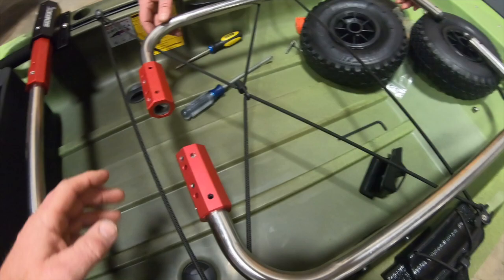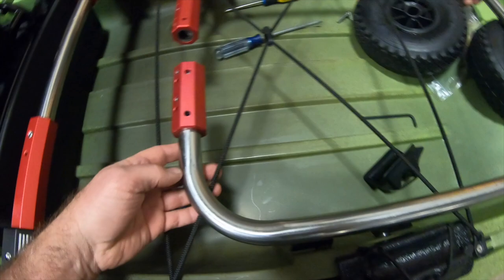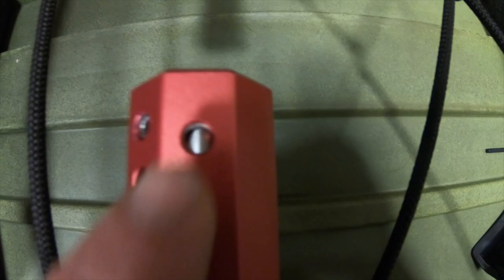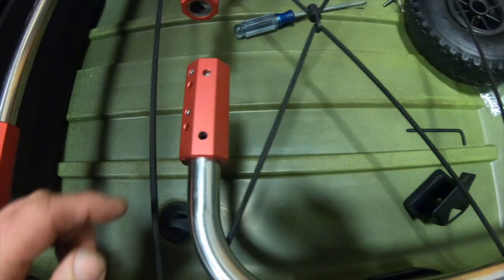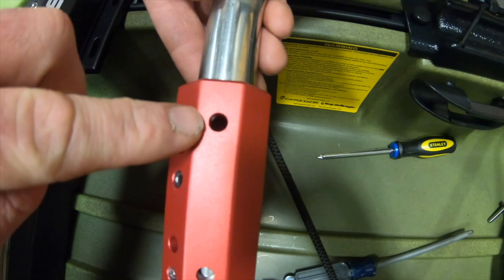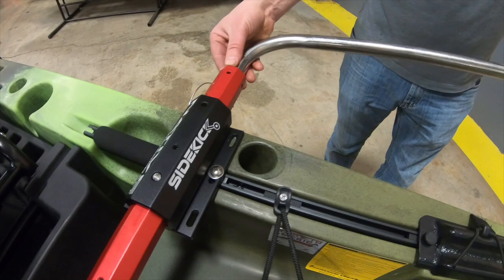Next you've got to figure out which is your left and which is your right leg. Lay the legs down and look for one hole that goes all the way through the red and the stainless steel leg. You can see that hole goes all the way through, whereas this one hits stainless steel. If it's on the upright surface and there's a through hole, that's the side it needs to be on. So this leg goes on the left side of the boat. Then we look at the other one — it's got two holes, one that goes all the way through — that's obviously the right leg, and that will insert.